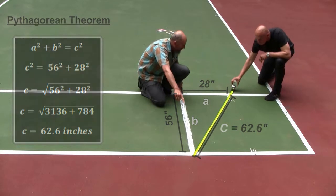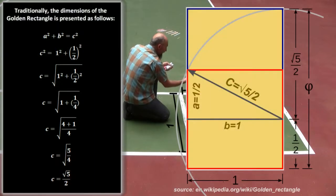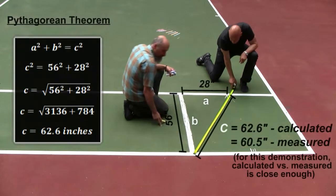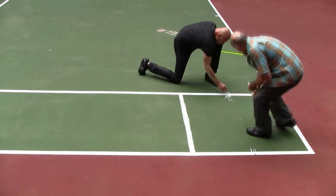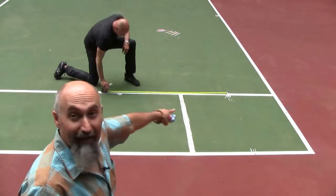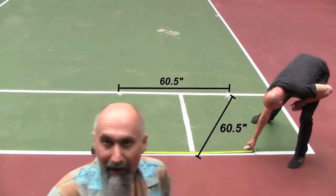If you think in units, this is one unit and that's two units — this side is half that. We're going to do the diagonal in yellow to find where the golden rectangle ends. We measure from the middle to that corner, and that distance is 60 and a half inches. We go from that corner all the way to this corner — that line ends up being 60 and a half inches, and we transpose this length.